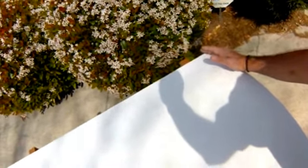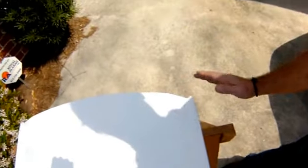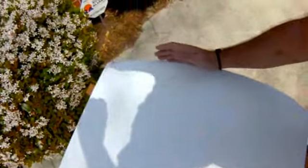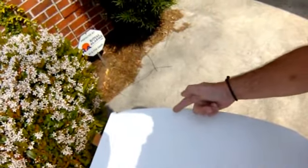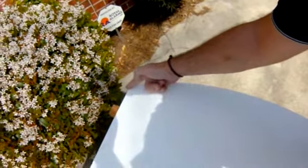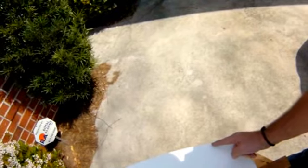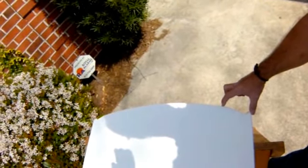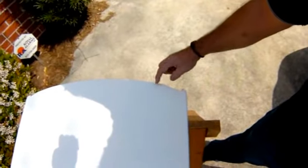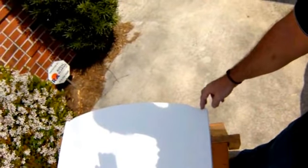There's too much of an arc, to where it can't fit — you'll see that on both sides. You want that arc to follow along perfectly on the sides until it can't go any further. Then simply draw the line of where it finally joins back in to the arc that's already on the board. As you can see, it only leaves this join about here and then comes out about here — that's where we need to notch in.